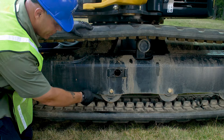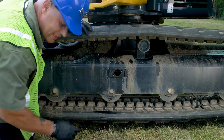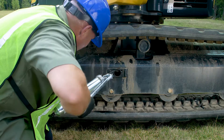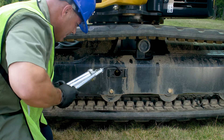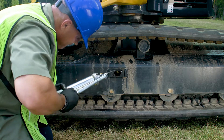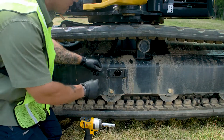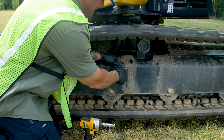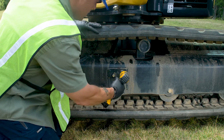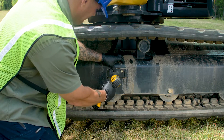So in order to check the track tension, measure between the bottom of this wheel and the top of your track — you're looking for 0.3 to 0.5 inches. This one's out, so we're going to go ahead and add some track tension to it. As you can see, the track's starting to suck up. That looks good right there. Once we get track tension adjusted, go ahead and cover back up the access, put the bolts back in, take your 14mm and tighten it back down.